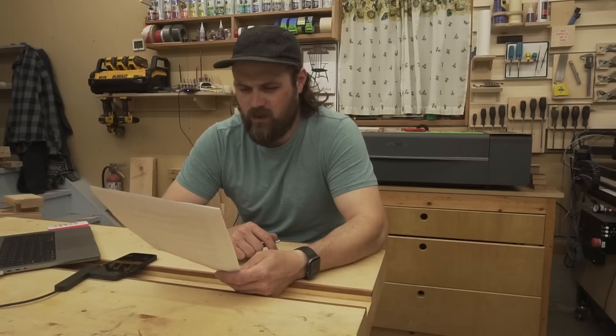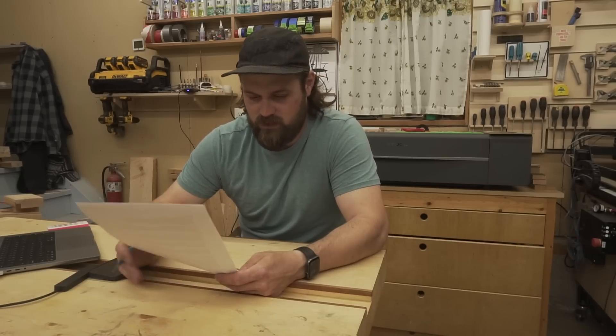So, one-inch thick material — can it cut one-inch thick acrylic? Xtool has a video of them cutting one-inch thick clear acrylic, so it can do it, but I don't think it's feasible. The pink material I cut was three-quarter-inch acrylic and I could get through that with one pass. So yes, it can cut one-inch thick material, but I would say it's not reasonable to do that.